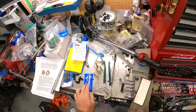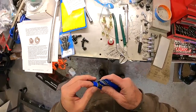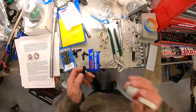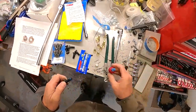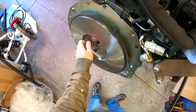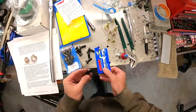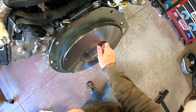We're going to take these bolts and throw a little bit of the thread lubricant up under the head, then put some Loctite 242 on the threads. I'm pulling these two out so I don't forget which ones I've done and which ones I haven't. Make sure you read the instructions — you get the idea of what we're doing here.